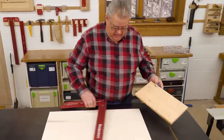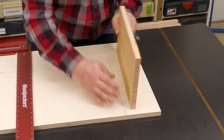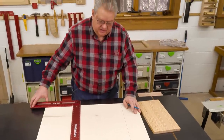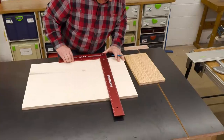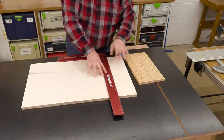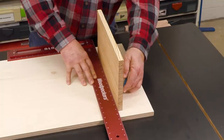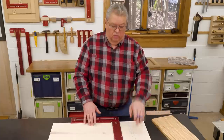So you've got to make two passes and cut the groove to fit. What I had done for a long time was lay this out, strike a line, then set my stock to that line, try and get it lined up just right, then hold it and mark the other side. It dawned on me a couple of weeks ago that I was making that job a lot harder than it needed to be. Now what I do is take that nice big thick heavy blade on my 2616, get it where I want it, strike my line, and while that's still sitting there, put my stock up against the 2616. That gives me a very positive reference — I'm not trying to eyeball it to the pencil line. Now I can mark that with a much better degree of accuracy.